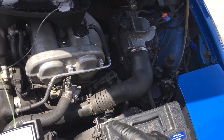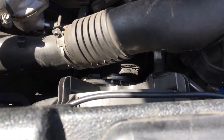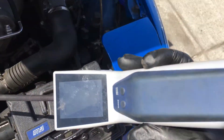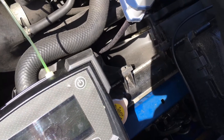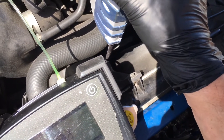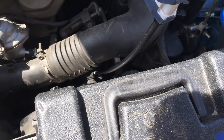Oil accumulation around the clutch shaft seal is normal over the years — you do get a slight seep of refrigerant oil coming out of there. It coats everything and oil dust accumulation builds up. You can see it at the tip of my finger right there. Now let's take the Stratus. We have it in super sensitive mode — it should pick up anything. Sitting right on the hose, right at the leak point, and there's absolutely nothing.